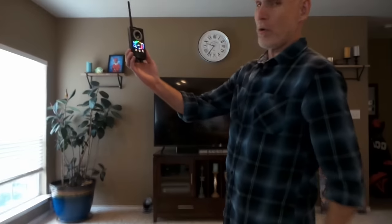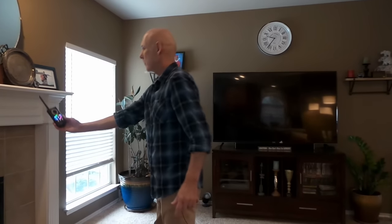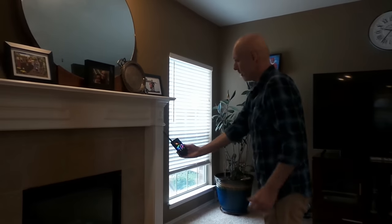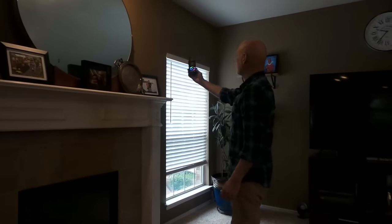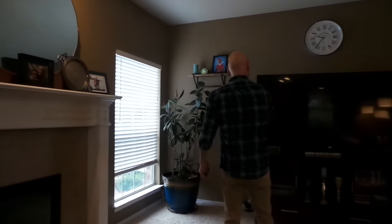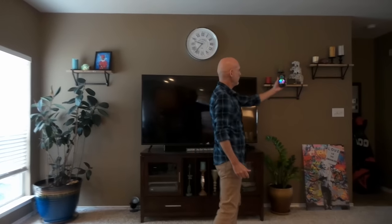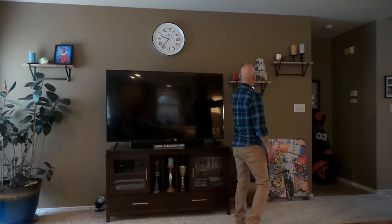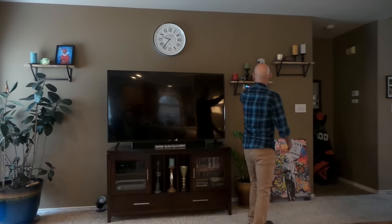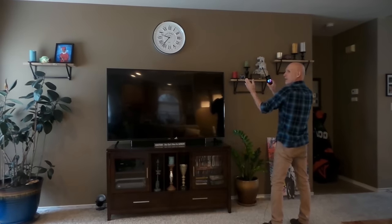To sweep the room, you're literally just going to walk around — go up and down, get closer to the walls. If you see the needle start going up, there may be something over there so you want to check it out. Get closer. It could also just be random wi-fi signals from your neighbors or your own wi-fi if you haven't turned it off. Sweeping around the room — starting to hear something over here. Feels like there's something over here, so I'm going to turn the sensitivity down just a little more to bring me in closer to whatever it is.